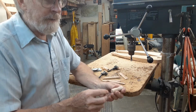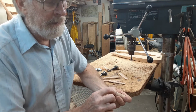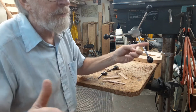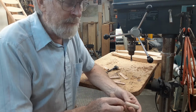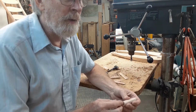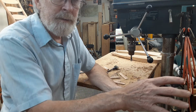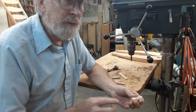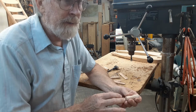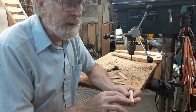And when you're making those wedges, you got to remember that they are basically just filling up whatever kerf you have, plus a little bit of squeezing or pushing out power. If you make those wedges too fat and you're trying to drive this down into a blind hole, or trying to drive the arm into the mortise, if those wedges are too big and won't go all the way in, it's going to mess up your alignment. So they've got to be carefully made. And then they've got to completely disappear.